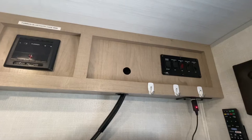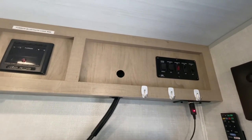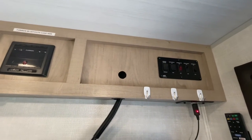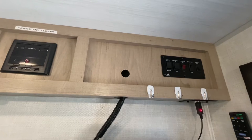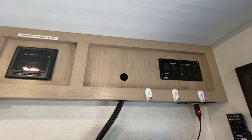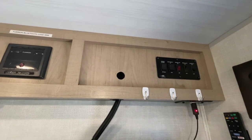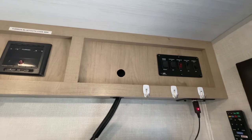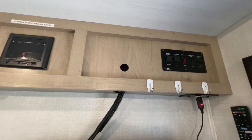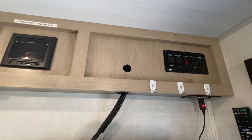This should really be a quick install. I stole a battery off another camper I have that I just put a big solar system on and put a 200-amp-hour lithium battery in. So I took off the regular lead-acid deep-cycle battery — same brand, same age — bought a dual battery box, and slapped that on the front. Now we've got double the battery capacity.